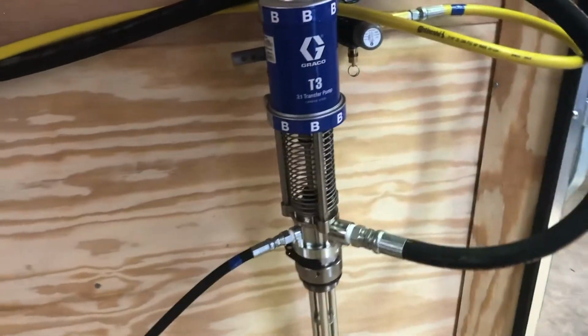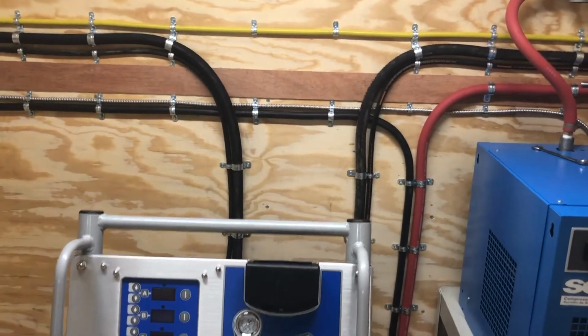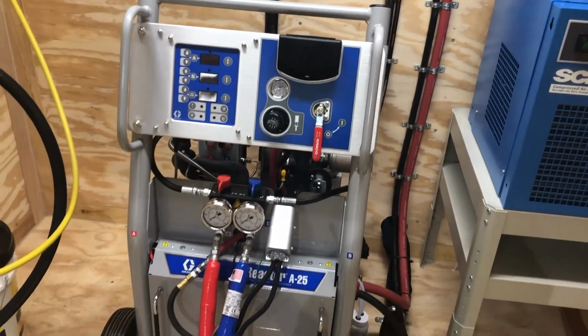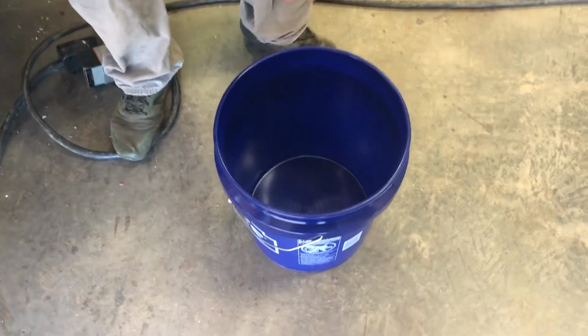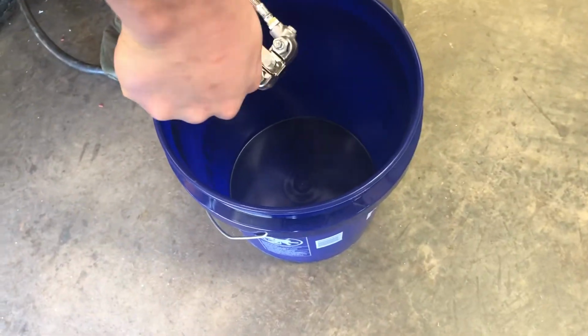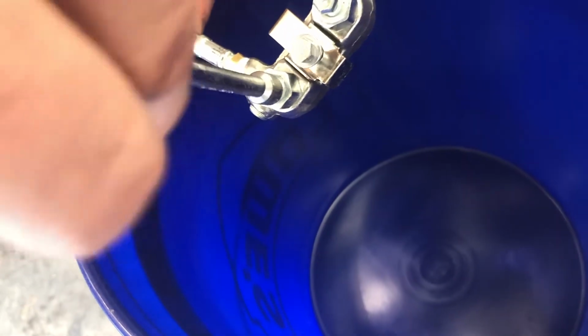So we've torqued out now, which means we've put as much pressure as we possibly can into this system and into the hose. When I open the valves on the hose, on the gun block, we're going to get a lot of air out of it, and then we're going to get hydraulic oil. So let's jump back up front. All right, guys, I got some help here so I can hold the camera. What we're going to do now, we're going to go ahead and just open these up. Once you put foam in here, you're going to be purging out all this oil if we've not already done this for you. So hear the air coming out? Drum pumps in the back are priming the system. You can probably hear them.